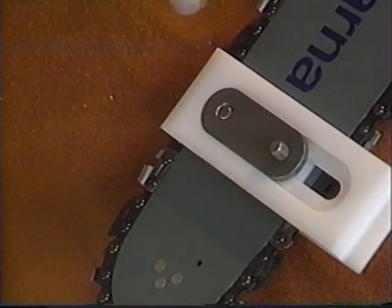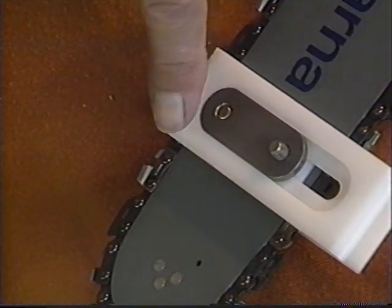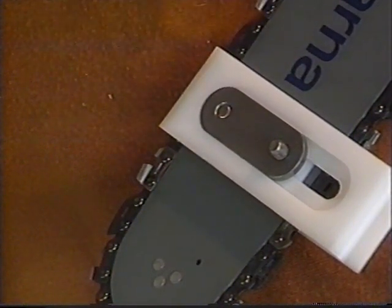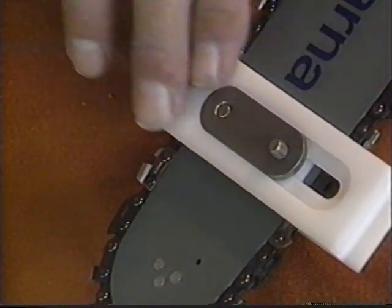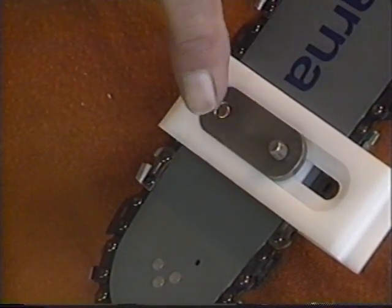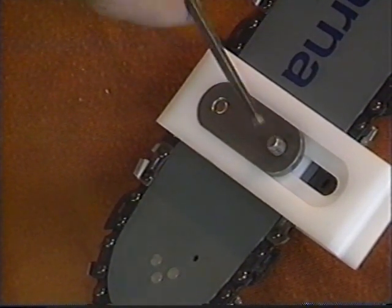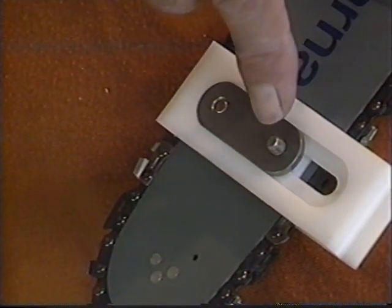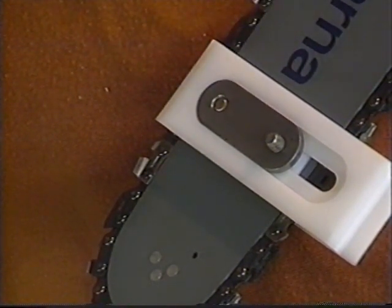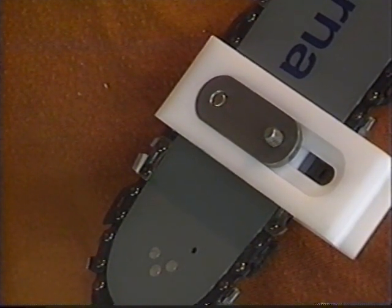We want to have as much of the screw remain intact as possible so that we get a good firm grip on our threaded plate here, but not too much to where it starts scarring up the fixtures that this plate will be riding on. So we want to get all of these short, and we're going to do that by sanding. These are stainless steel screws, and you can grind them, but it kicks up a burr. But I found that disc or belt sanding works pretty well. So we're going to take these screws out and machine them shorter.